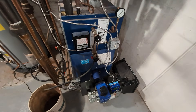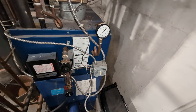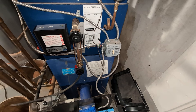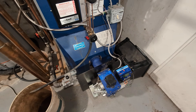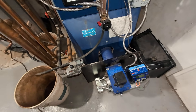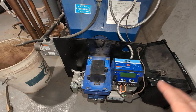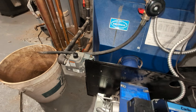Welcome to my channel. Today I wanted to go over the install we did with this boiler, a 2013 Columbia boiler. It's originally designed to fire oil, but it was approved to run gas. We decided to offer the customer the option of a gas-powered burner in place of oil to allow for fuel flexibility. With the power burner you have more complexity and noise, but you have fuel flexibility — whatever comes through that pipe we can adjust.